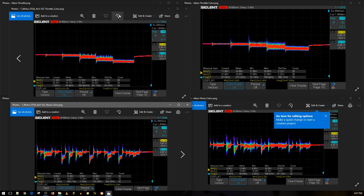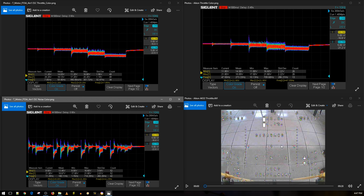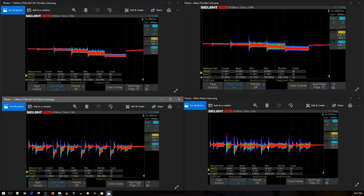Here's the T-Motor F55 amp ESC — this is one of the top-tier ESCs I'd consider, especially for 6S since I've used them with 6S. As you can tell, the T-Motor F55 is much cleaner, and the reason I say that is because you can see exactly what the motor is doing through the voltage trace. Right here when there's no throttle it's a flat line, then as soon as you give it 100% throttle look how low it dips. Here it's kind of difficult to make out what's going on — it still ran pretty good but it does have very high-frequency noise.